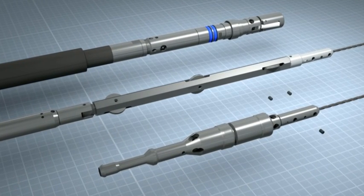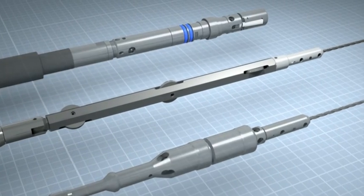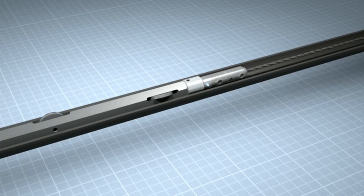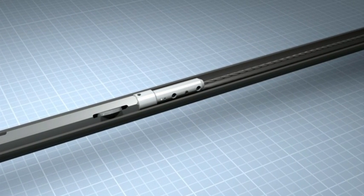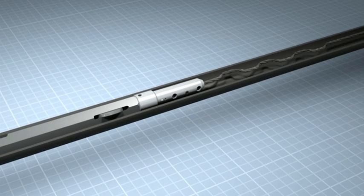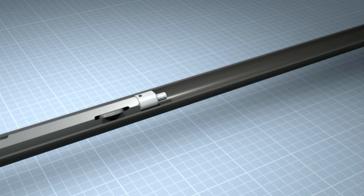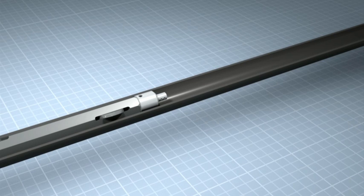The free-falling and pump-in Overshots are connected using grub screws. This simple connection removes the need for on-site splicing. The Overshots even incorporate a load pin designed to allow the wireline to break off in the event of a stuck inner tube. With this predetermined break point, the system is safer and saves on the loss of your wireline.